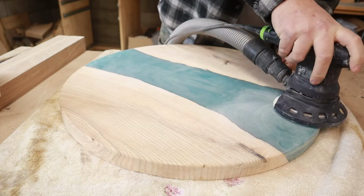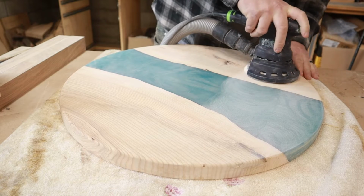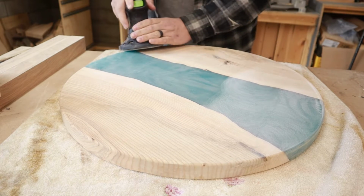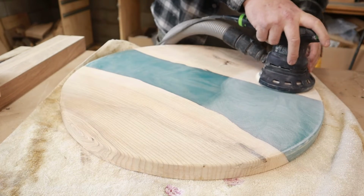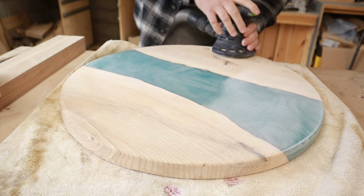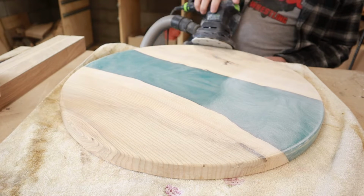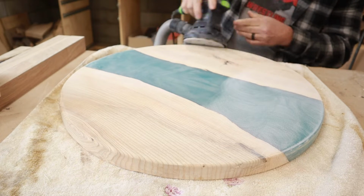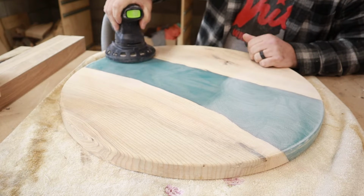I felt some of the machining I had done may have had a negative impact on the sanding surface that I did previously. So we're going to come back in here, and I'm just going to do a nice sanding job. I'm also cleaning up a little bit of the router sanding just to make sure that there was a nice transition from the surface to the round over. But we're going to bring everything up to 320 grit sandpaper. That is enough for what we're going to do.